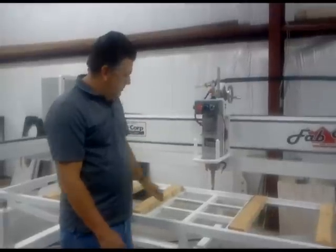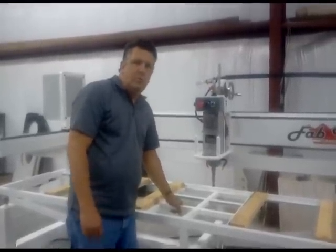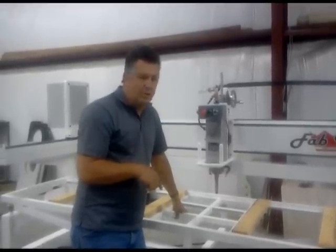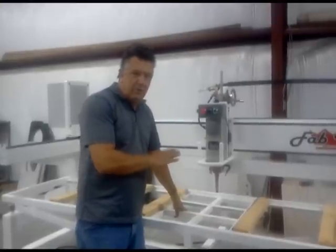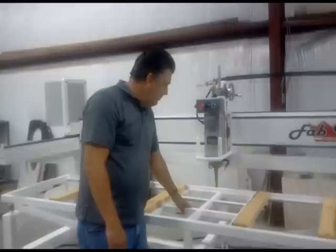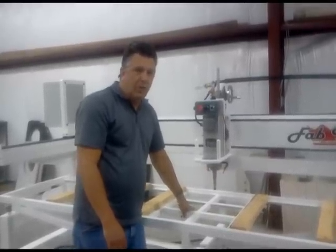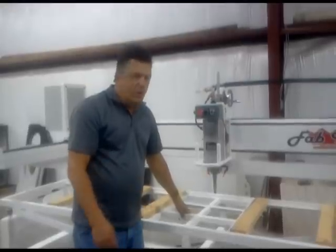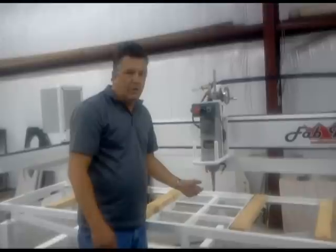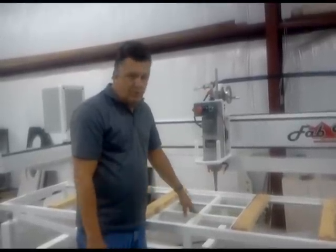The machine comes with a bowl hole catcher, which is used when you use polishing wheels to do the inside bowl polishing. If you're going to polish the bowls by hand, we don't recommend that you use this item, because what this does is increases possibility of blowout on the bottom of the bowl as you cut it out. Since there's no support under the bowl cutout, it has a tendency to break and blow out the bottom. So again, if you're going to polish them by hand, we recommend you don't use it.